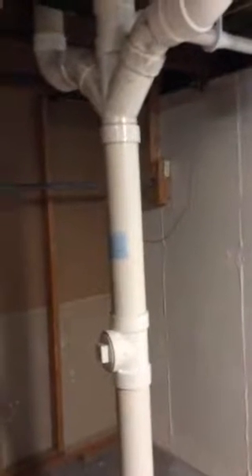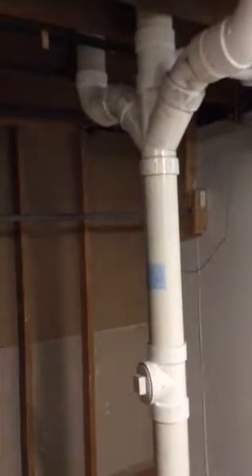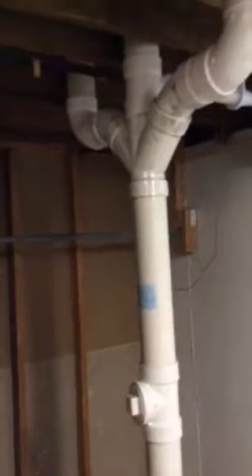On the flue — there used to be a gas water heater in the past, so there's already a three-inch connection on the swivel tee right there. You're going to need approximately — from there to the wall where it's going to be — about 10 to 12 feet of three-inch pipe and probably three elbows, and that should be plenty.